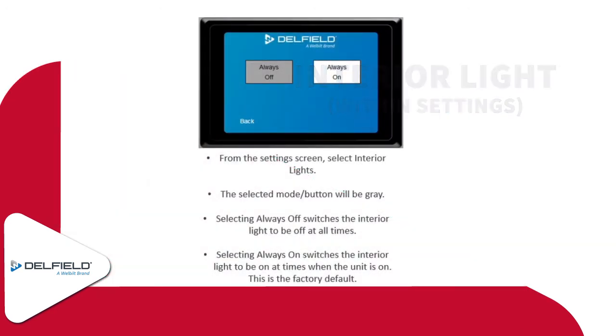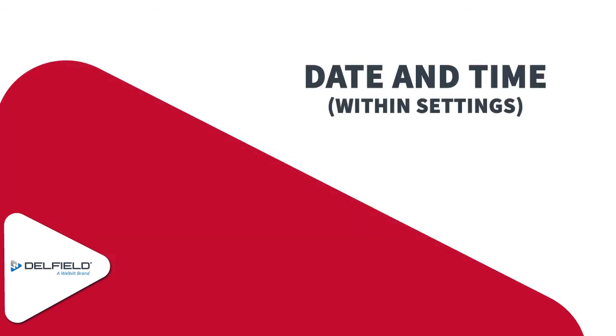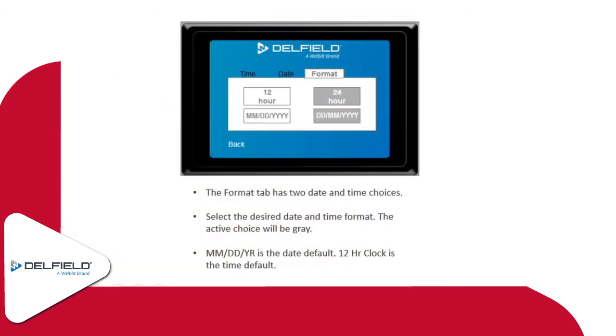The interior light, we normally have those always on. There is an option to turn those off. The date and time settings, like I mentioned, are pretty critical on these, especially when it comes to setting the adaptive time of day defrost, and then certain errors too. So if there's a pattern developing where we're getting some high temperature alarms, let's say, and it's always occurring around the same time every day, it's much easier to pinpoint what might be going on at that time. Maybe it's an operational issue.